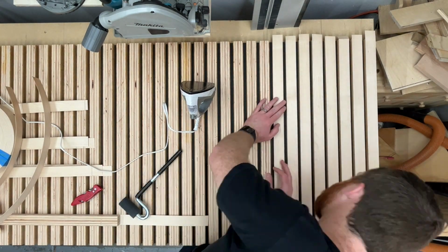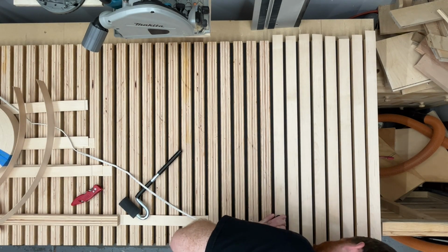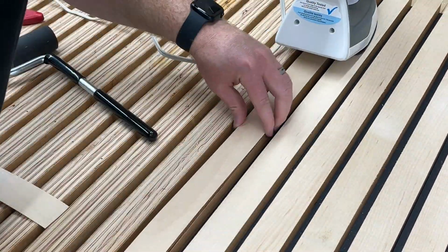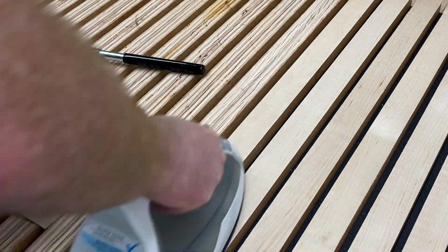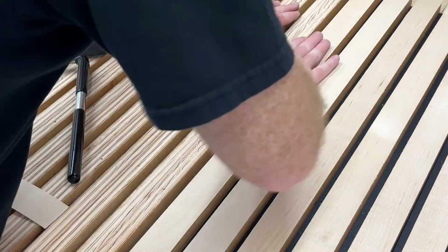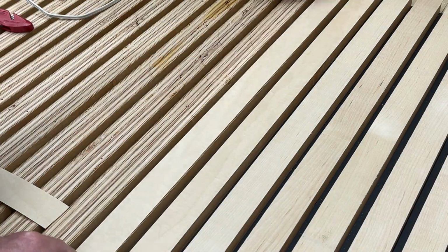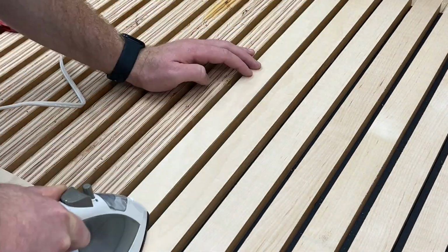And since the panels are 3/4 inch plywood glued together, that's 1.5 inches, and this is 1.5 inches edge banding, you have very little room for error. So you want to make sure those are put on properly. There is probably like a 32nd of an inch on each side, but again, typically you would have a lot larger hangover for the edge banding.